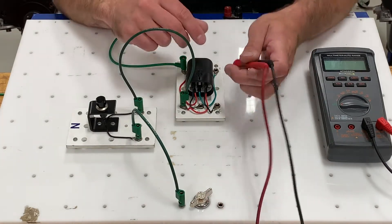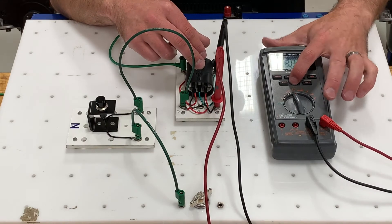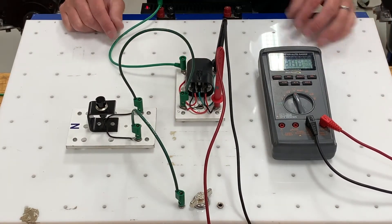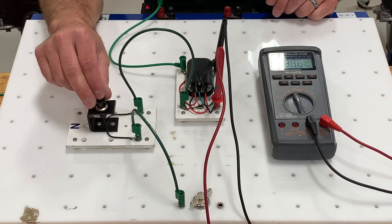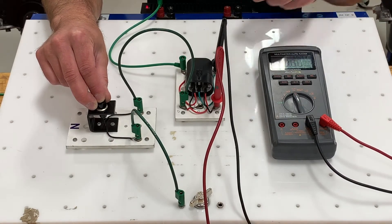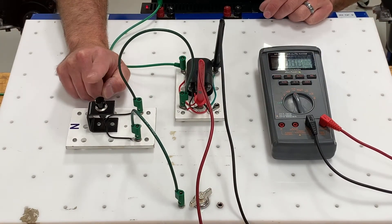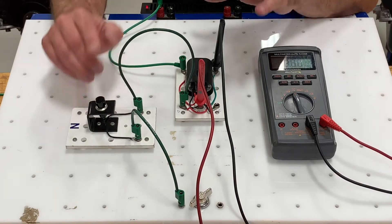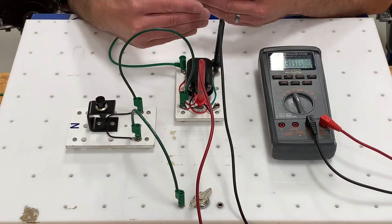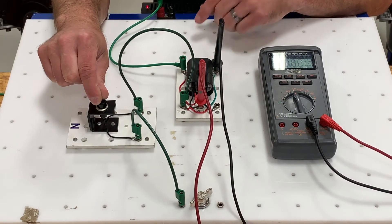At this point, we can confirm what's going on by using our meter. If I set my meter to do a continuity check, right now we're in the normally closed position and I'm getting an audible beep from my meter to show that I've got continuity. Once I press this button, that goes away because now I've gone to the other position of the switch. I can move my meter over there and repeat that. Now I've got an open circuit with the relay off because I'm in the normally open position — meaning that's the position of open circuit when this relay is off. But when it is energized or turned on, I get continuity.